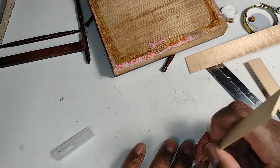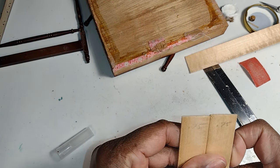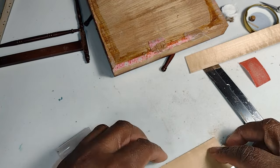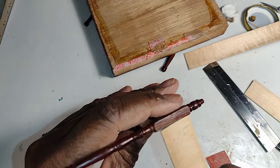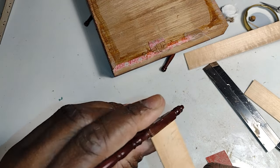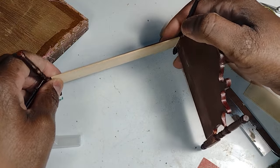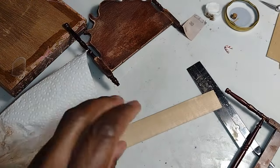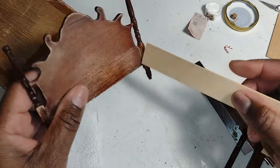Now that I've cut my two pieces and sanded them with my new sandpaper, they're relatively even. I'm going to run them across the sandpaper a little bit more and then glue them to the headboard and footboard. As usual, always try fit — dry fit — to make sure everything lines up before adding glue. I really like the way that side rail is going to hit on the bed post, so let's go ahead and get this together.